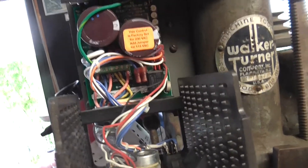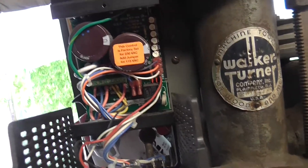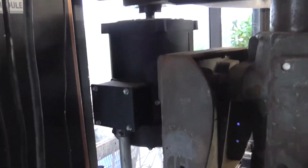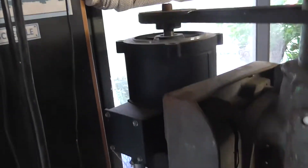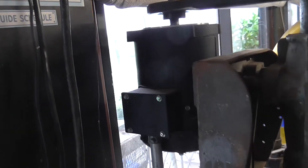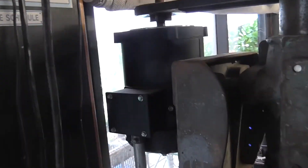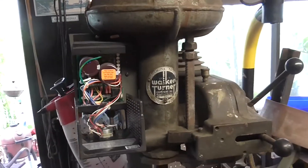For what I do, I just have it start up relatively quickly and stop relatively quickly, but not instantaneously, because stopping instantly generates heat to dissipate that energy — like when you see a lathe wind down and stop, there's a big heat sink back there that takes that load. These switches are what make this device better than the others in my mind. For somebody who doesn't want to tinker with programming, this is perfect for this machine. The fact that I can pick up a three-phase half-horsepower Leeson motor — a good name brand — for around 50 to 65 bucks scratch and dent on Amazon, it's unbelievable.